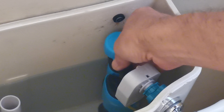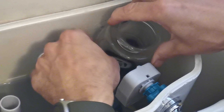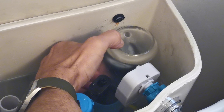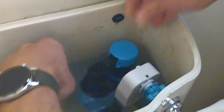After that pipe deburring I thought it wise just to check there was no debris in the fill valve — this was the other reason I mentioned for having an isolator valve close to the cistern. With the water supply switched off at the valve, I could turn the arm on the fill valve anti-clockwise, lift the assembly away from the valve, and turn the water supply back on with a glass over the valve to prevent splashing. I also removed the diaphragm washer and gave that a rinse, then reassembled the valve and switched the supply back on.